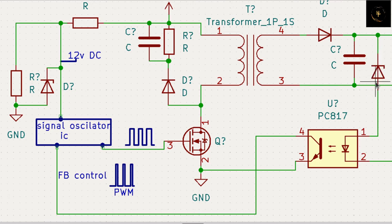If here is 12 volt or more, that means the difference between these two points is always the zener diode voltage. I think you understand that - if your zener diode is 12 volt, then the difference must be 12, that means your meter shows 12 volt from this path to this path. If it is 6 then you get 6 volt, if it is 8 then you get 8 volt. That is the basic of zener diode.